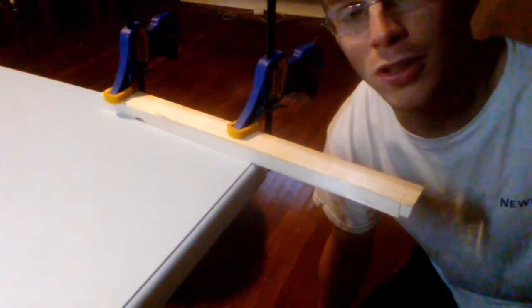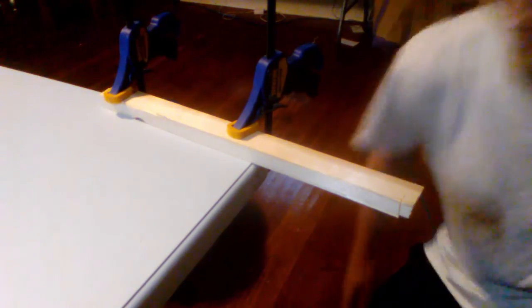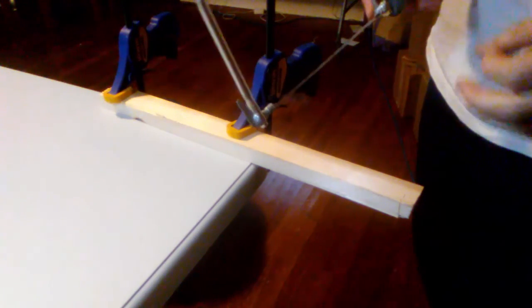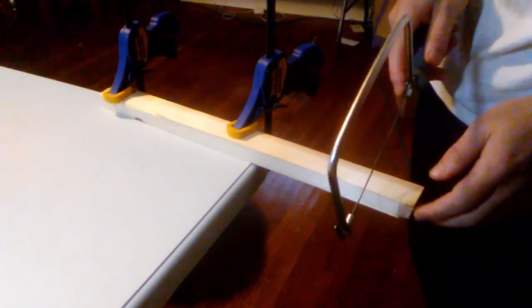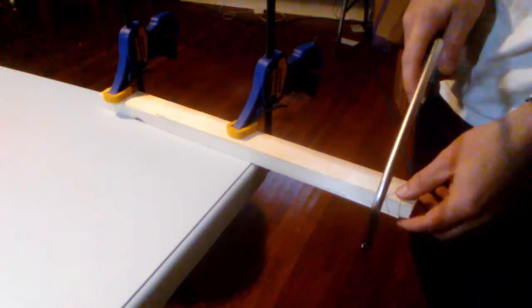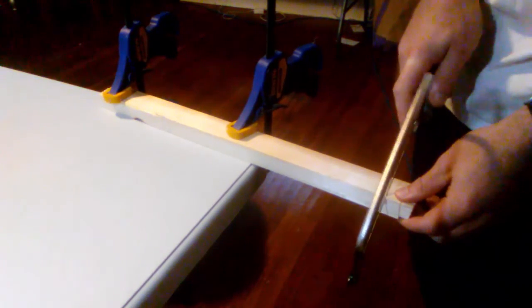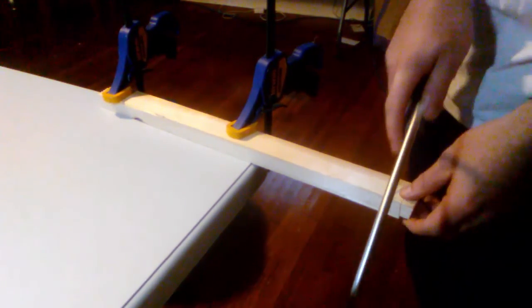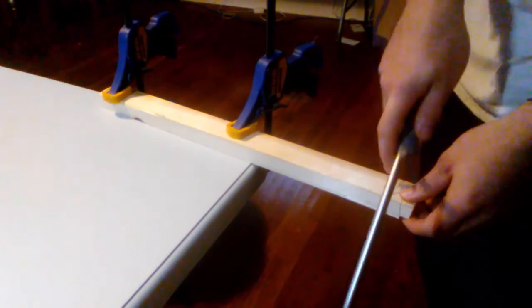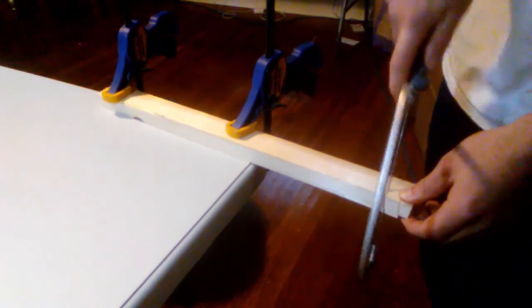In this next part I want to show you some basic cutting technique with the coping saw by example. The first thing is to demonstrate cutting speed. To make your cut, mark a spot with a few straight push strokes — this keeps you from losing your groove when you're cutting. Push strokes mean you're not actually ripping much wood and you have much less resistance. Now you have your spot marked: apply a very small amount of force downward but move the blade quickly. This is the quickest way to cut with a coping saw.